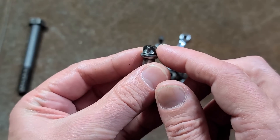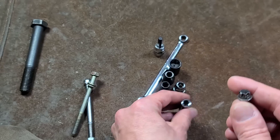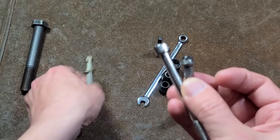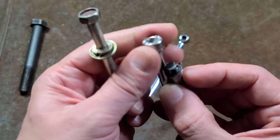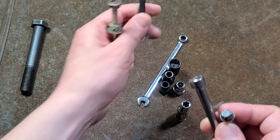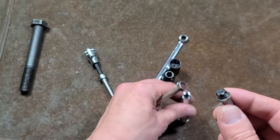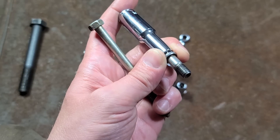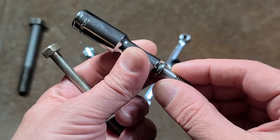There are two reasons for this fastener. One, it allows you to use a stronger drive tool — essentially a stronger drive socket — for something that has the same exact head size for the shank. So all three of these bolts have the same metric and they have 8mm shanks on them. But this uses a 12mm socket. This uses a 6mm hex driver. And then the external Torx actually uses what's known as an E10, although that doesn't correlate to internal Torx sizing or even hex, or in a pinch using hex-based tooling to operate with them.